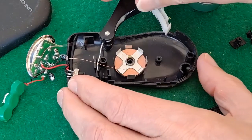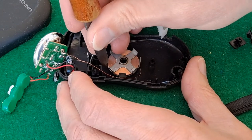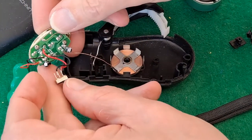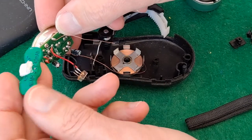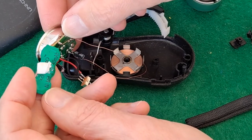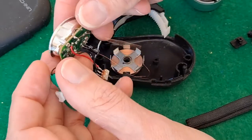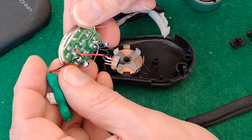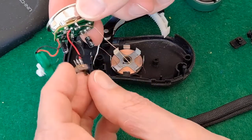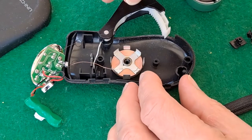The reason it's not working is that wire is broken. I hate these fine wires, but I might be able to re-solder that on the end there and get that one working. Other than that, the circuit board will have a circuit to charge up that — exactly the same battery, funnily enough — nickel metal hydride, 3.6 volts, 40 milliamp hours. So that charges it up and lights the LEDs, but there's no charge in it so it's not lighting the LEDs. So what I'm going to do is see if I can re-solder that and see if we can get it working again.